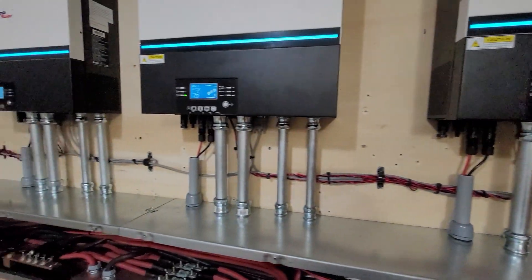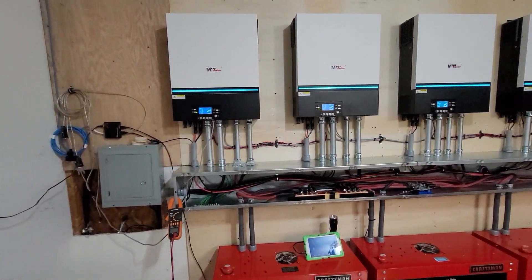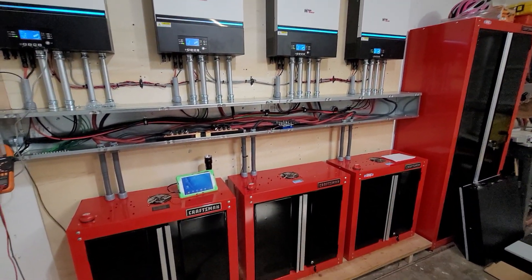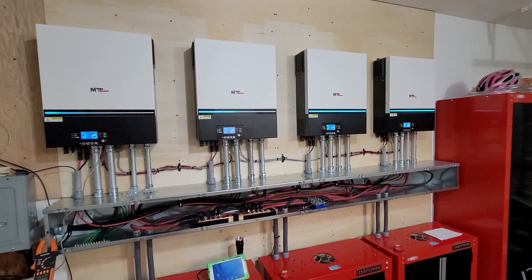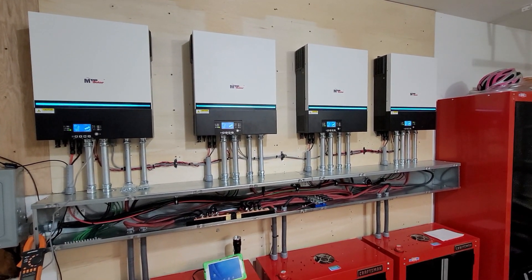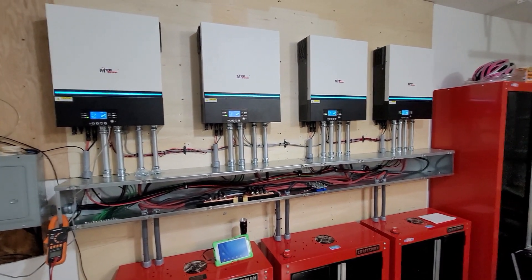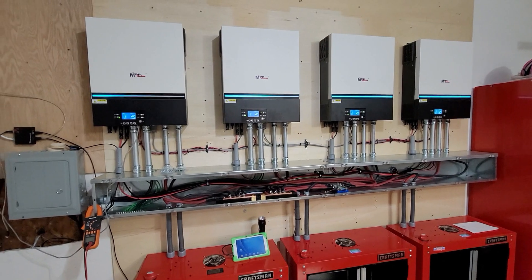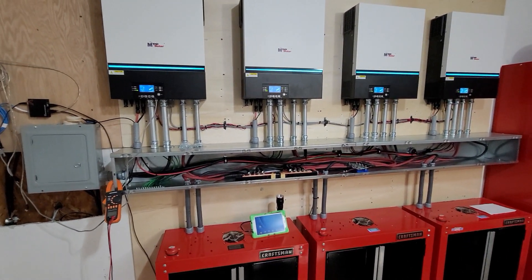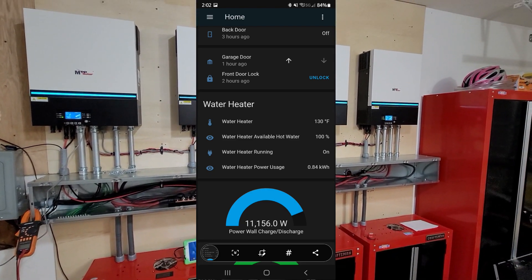I think the system looks cool, it performs well, and so far in the last four days the system has been performing flawlessly since I switched off-grid. I did not have a reason to go back on it. The highest production was today since I installed the last six panels and hooked up the fourth string — the highest production today was around 13 kilowatts at around two o'clock when the batteries were almost full. I will make a video in regards to shading a little bit later, but yeah, about 12 and a half kilowatts — you'll see a picture on the screen of how much the batteries were absorbing today.